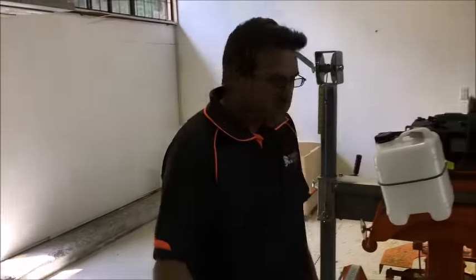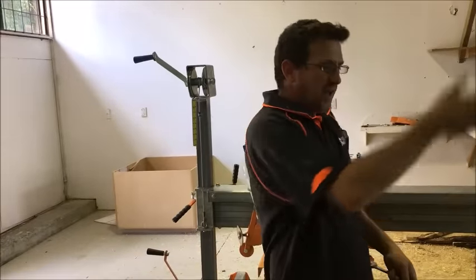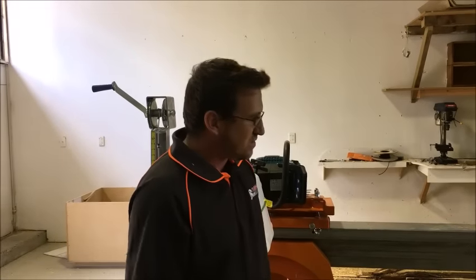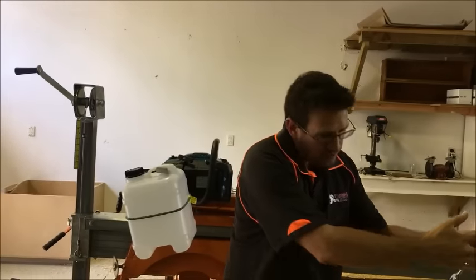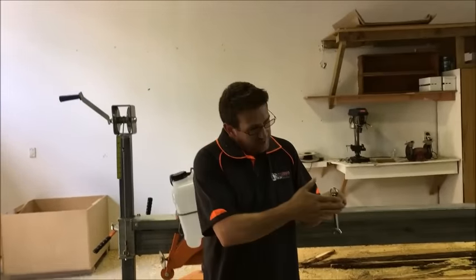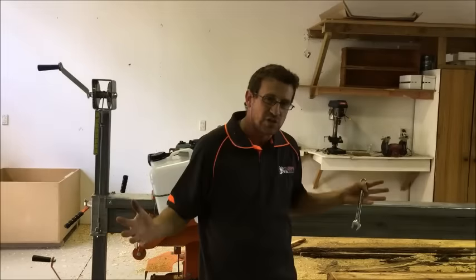And we can do the exact same thing. We'll drop it down, say a 3-inch, we'll cut a board, and then we'll drop it down an additional 3-inch to make your 6-inch. Really, the telltale sign of getting your blade adjusted is that when it comes through the log at its deepest cut, it exits clean. It doesn't go zing, doesn't make weird noises. It exits clean, and you should be able to drive it right back into the cut without spraying sawdust.